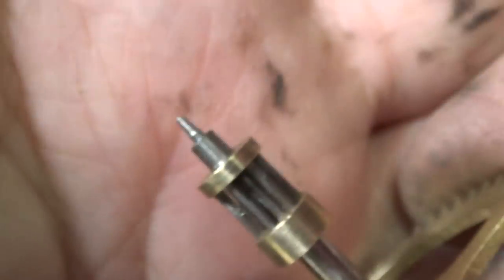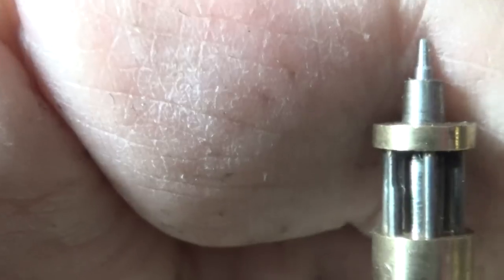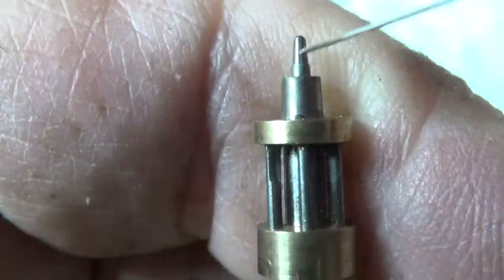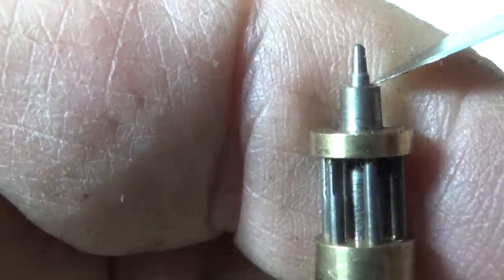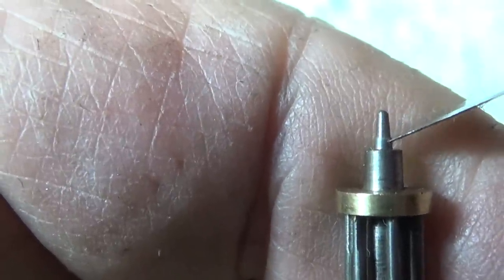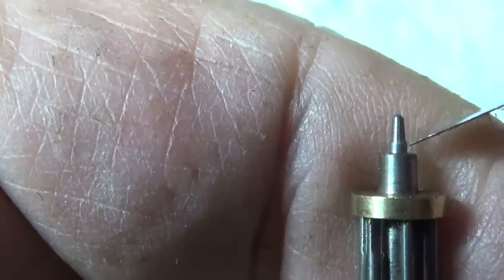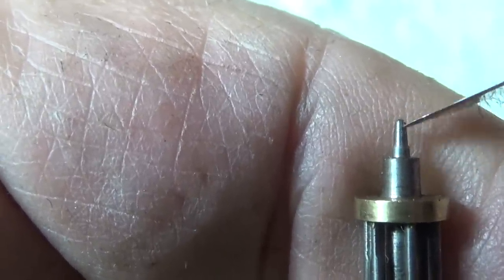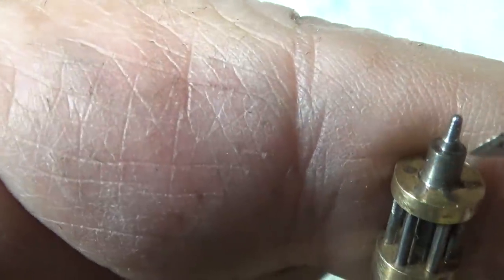This, look at that pivot. That's supposed to be cylindrical in shape. And you can see that's anything but a cylinder. Here's the shoulder of the pivot. And you can see that's worn here, and that's worn at a taper. This is that one that was in a pivot hole where this didn't extend all the way through, so it was actually being worn in a, like a tunnel in the bushing, and it's just a mess.